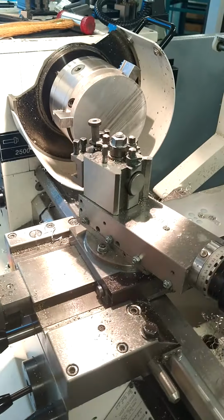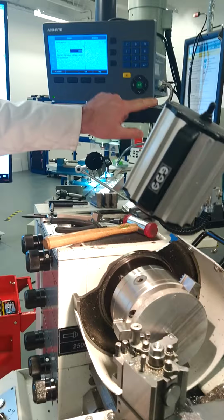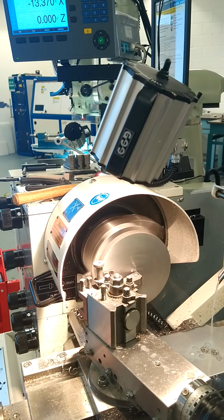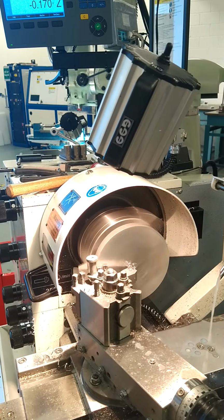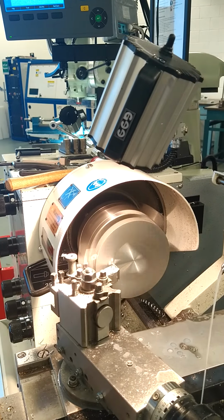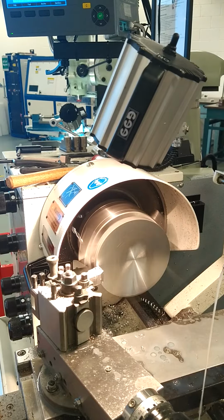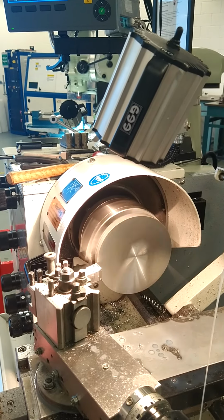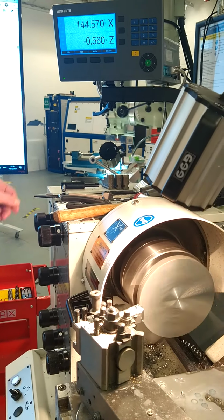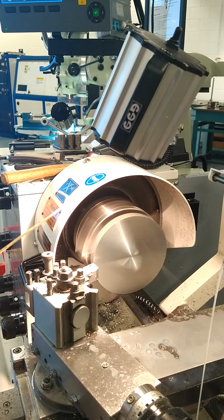So we're going to again repeat the process, set the tool off the center, set our Z, power on the machine again, and you're going to machine out the way, back out again, and then you're going to bring down this side to the correct thickness of 13. So before you take a measurement, you want to ensure you've got no saw cuts left. So I'm going to adjust in less than half a millimeter, engage my automatic feed again, and start machining down the part.